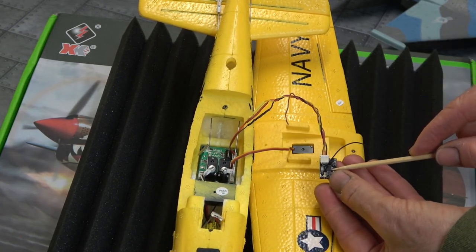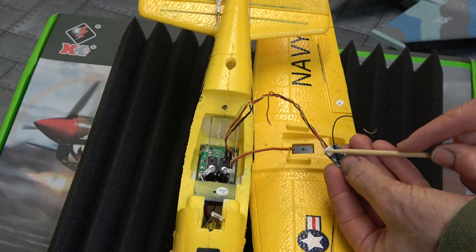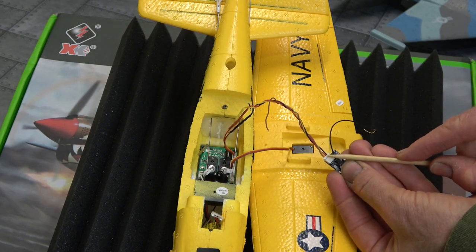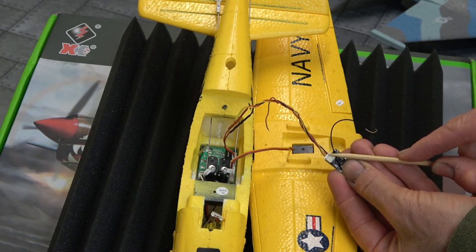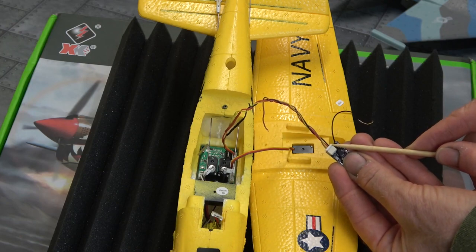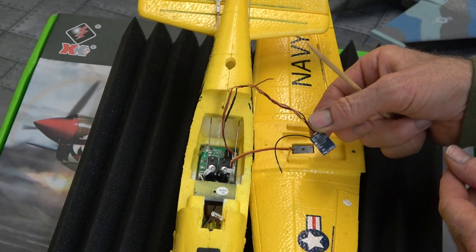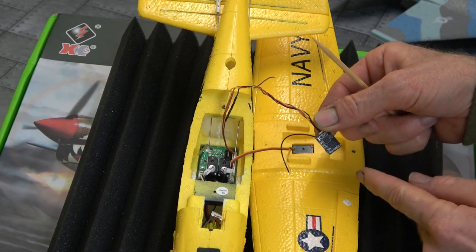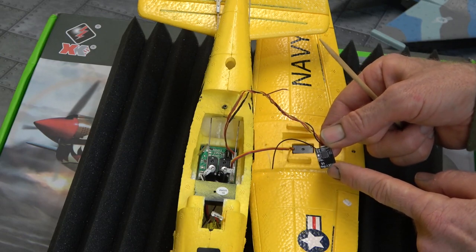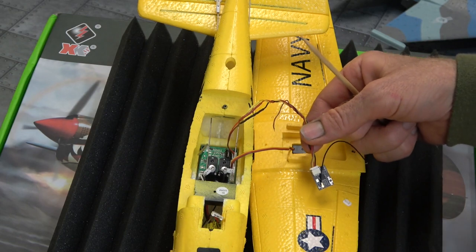On this one I didn't use the brown wire which is PPM — I used the yellow wire which is SBUS. Then the red one is power and the black one on top is ground. That's on my discontinued FrSky receiver. If you do watch my other videos, this one is discontinued now, but I'll start off with this one and run over it quickly.